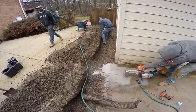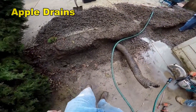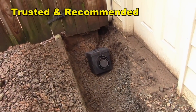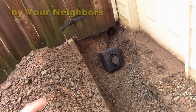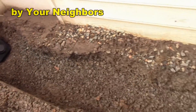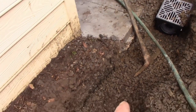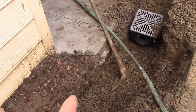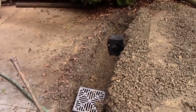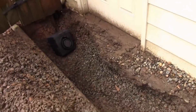Work progresses very quickly with three men. We already have most of the driveway side trenched out and already starting to run the piping. Remember how the system works: perforated pipe and gravel. This is a French drain. Water floods from the bottom up to the top — it fills up the gravel underneath and then floods into your pipe and the pipe carries it away. Catch basins pick up immediate surface water runoff, so as water comes across the ground it drops into the basins and is carried away. This is a good project for the do-it-yourselfer and you can save some money.